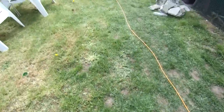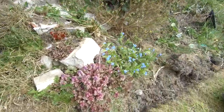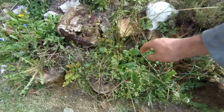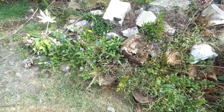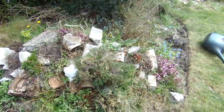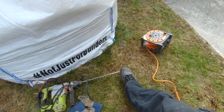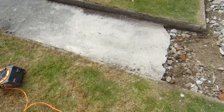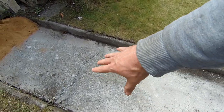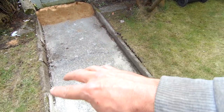Back to the path. That will just need covering with earth — put some plants in it and it'll end up like this one over here. We've got all sorts of alpine plants growing out of it: some thyme, chamomile is doing well, there's some pineapple sage coming through — it smells really nice. It does need deweeding, job for the spring. What we're going to do now is drill some holes in there with our SDS drill — I've got about a 16 to 20mm drill bit. The idea is we drill a load of holes so when the water seeps through the bricks, because we're only going to sand them in, the water's got somewhere to go.